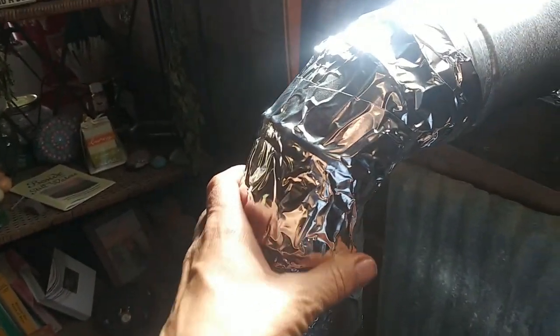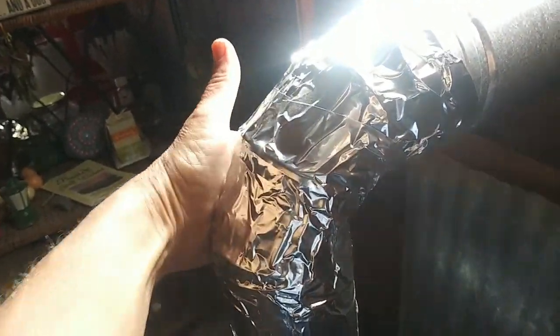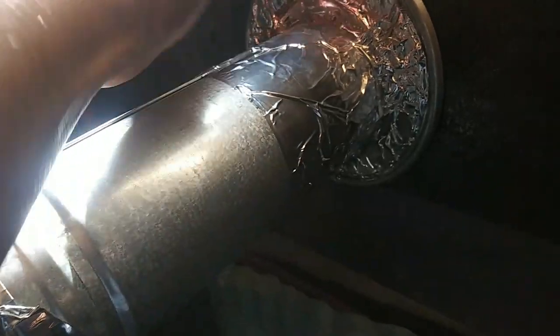I used the tape because this elbow pipe is just slightly smaller and I had to fit it down inside of here. So I just kind of filled the very tiny gaps with this tape, and same with this one — there wasn't too much of a gap there but I put it there anyway. This is actually a 4-inch wall thimble with a 3-inch pipe. I figured I'm just going to go ahead and use a 3-inch pipe with the 4-inch wall thimble, so there's a very tiny gap here. I sent it through and sealed the gaps.